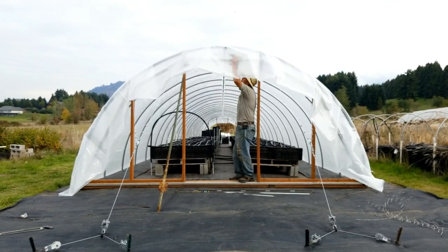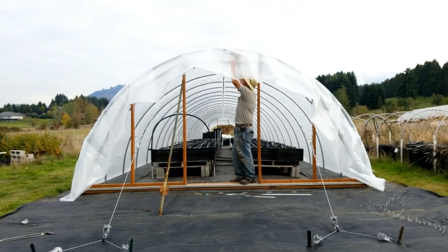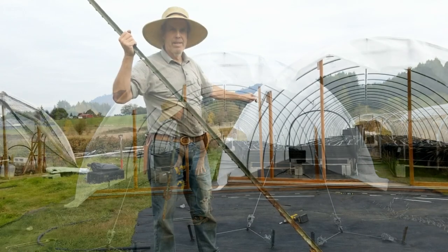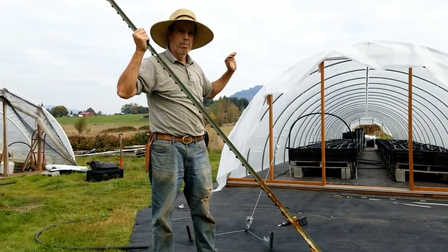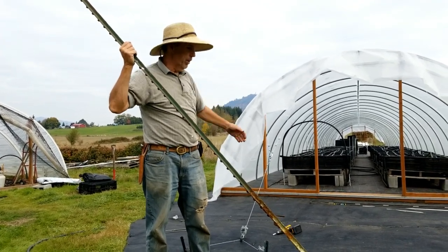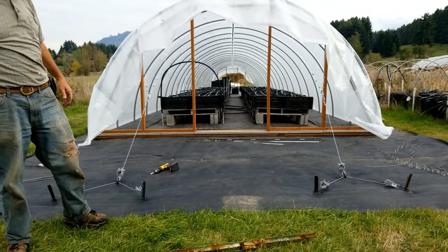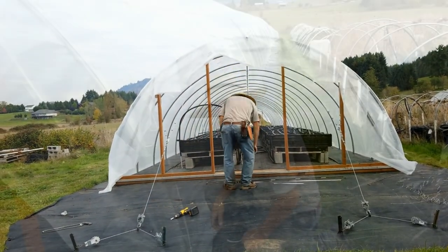So I gotta loosen this purlin bolt here. And then we're gonna cant it out. Yeah. To level. Okay, the T-post that you might have seen in the front was just used to brace the end in at the canted level. So we took that out, we loosened the purlin. Now we're just going to use our ratchet against the ground anchors and bring it up square. Denise is in charge of the square.